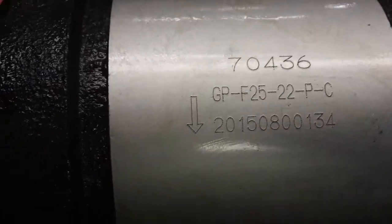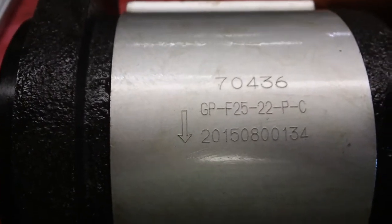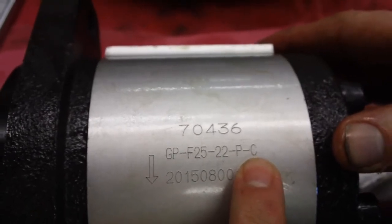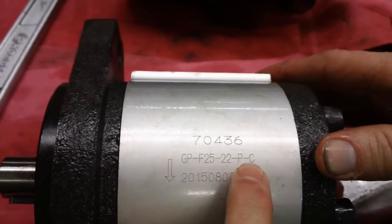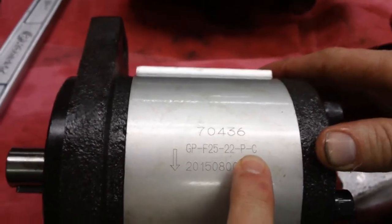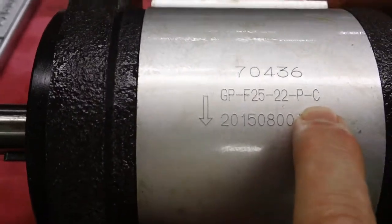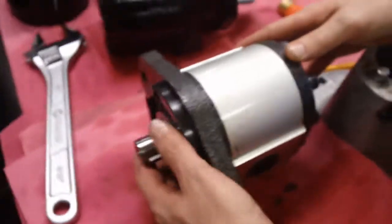Now if you were in the field — we changed this from clockwise to counterclockwise and back just to show some examples today — but if you were in the field and changing this from clockwise to counterclockwise, we in-house would buff the label off and replace it with an 'A' for anti or counterclockwise. I suggest you do the same in the field. That way there's no question. When in doubt, use the example we showed you for determining rotation.